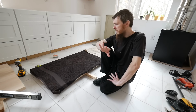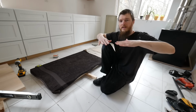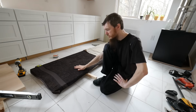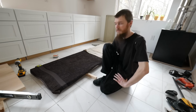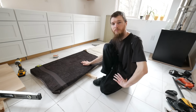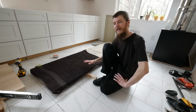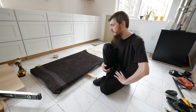It's getting better. So I figure with the metal wanting to straighten out, that metal's pulling it straight, and then we're going to apply more moisture through the top via the towels. I wet these old towels, put them on top here, and that'll hold moisture against the wood. I know this seems counterproductive. You never want a wet butcher block, but if we can wet this side, get it to expand while the bottom side is trying to pull straight, maybe we can get it better.